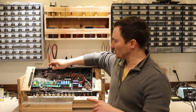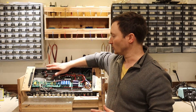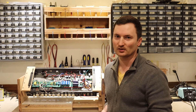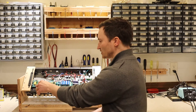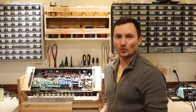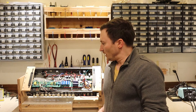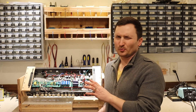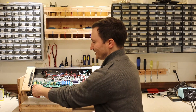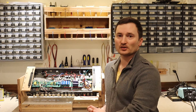One of the things I'm going to try is separating these wires. All of these wires going down along the control panel are low voltage and very low current, so there shouldn't be any crosstalk, but just to be safe I'm going to separate them and one by one eliminate any possible causes of that nasally tone. And then with the grounds — I'm pretty sure it's actually a ground loop causing the hum — so all of these ground wires connected here by the input, I'm going to one by one separate those and ground them somewhere else to see if that fixes the problem.